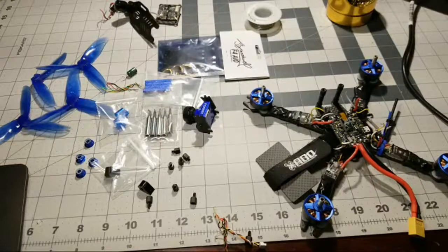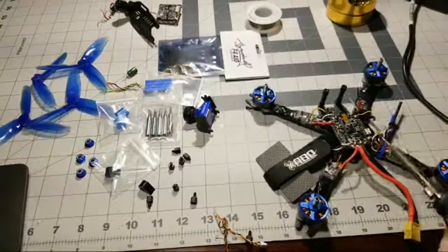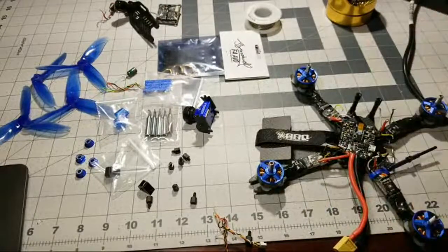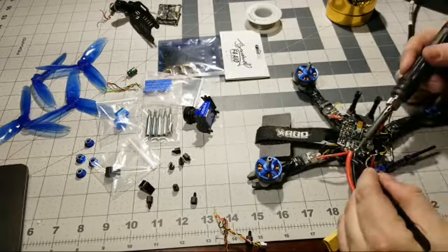Yeah, but when you go to 1,000, you're doubling the capacity. I would try it because they're like $2 shipped. I would just try it. You know what I mean? What do you got to lose? You already got the noise, so I would definitely give it a try. Those 1,000 microfarads are a lot bigger than the smaller ones.